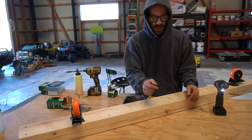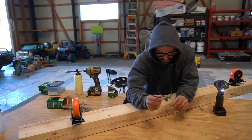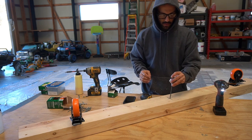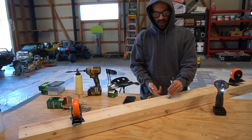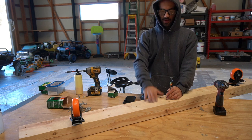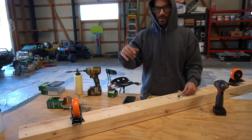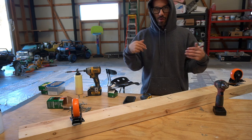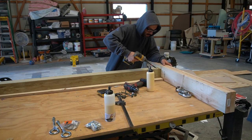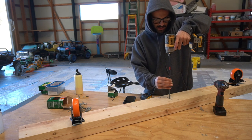Already did the back side. What that's going to do — with these power legs — is I'm going to screw in right here, and that is how my upright post is going to connect. I'll do one power leg and then come around the edges and do some Kreg jig pilot holes on the sides to secure it better. You can't just rely on one power leg — this is the bottom.